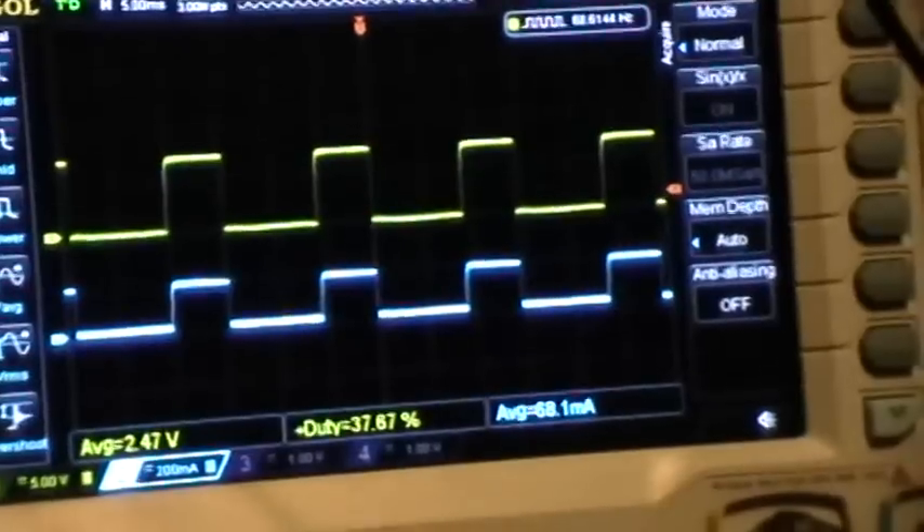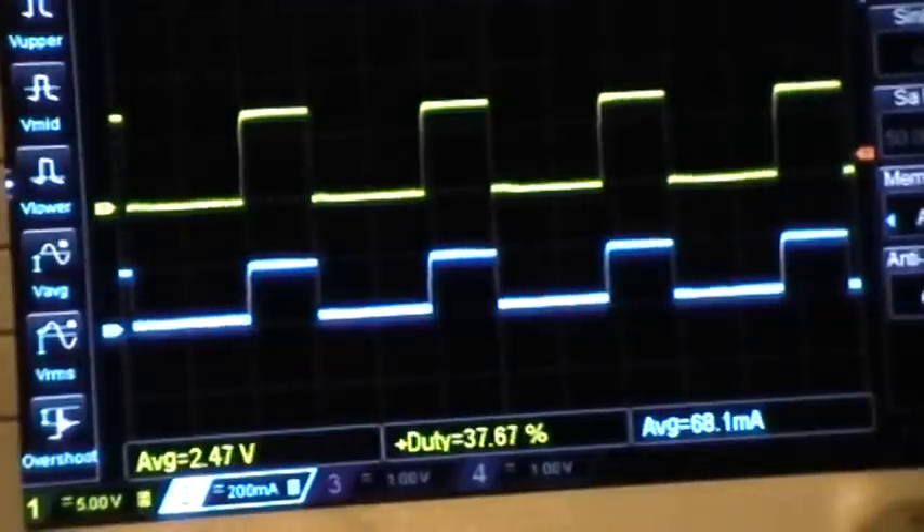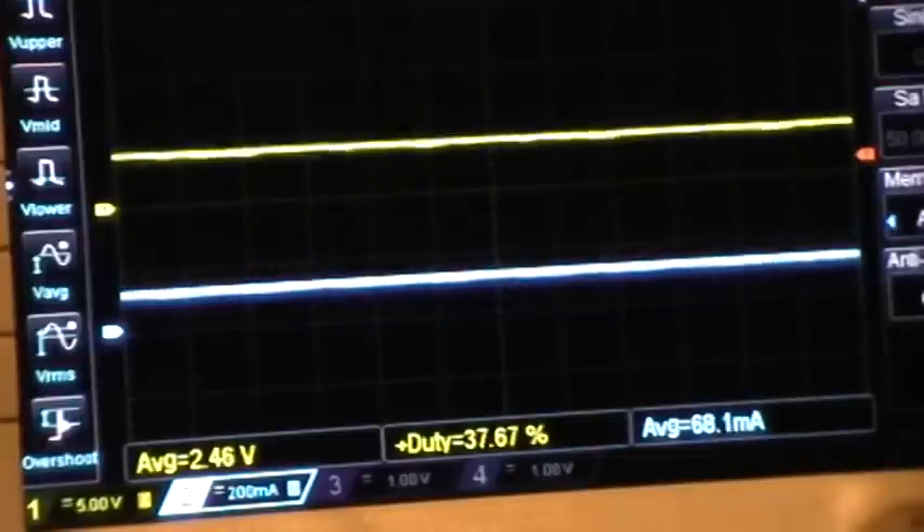I've basically used a MOSFET to simulate the rotor-triggering circuit of the Bedini motor — it's kind of a no-Bedini-at-all circuit. The scope traces are up on the Rigol scope as before. Here are the traces with the capacitors disconnected, and here with the capacitors connected.